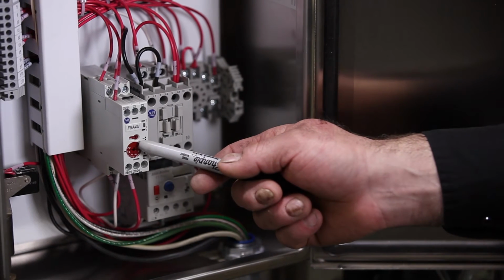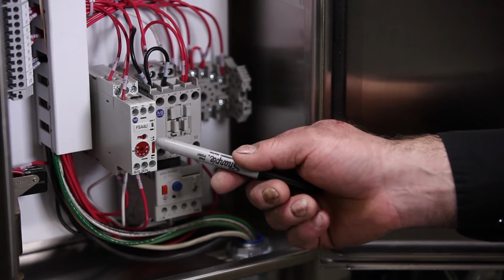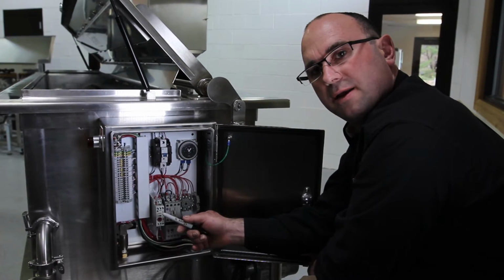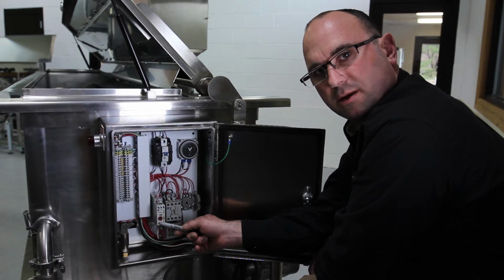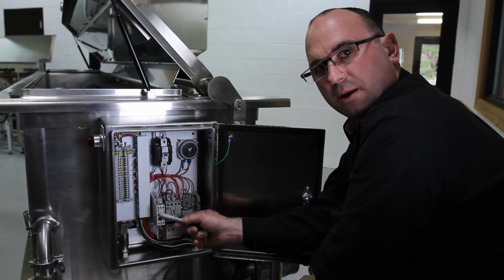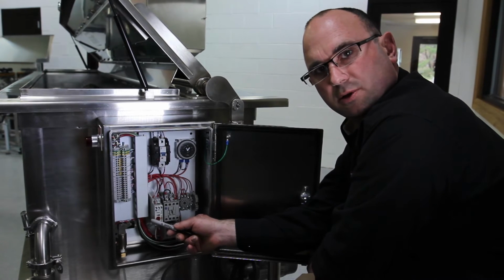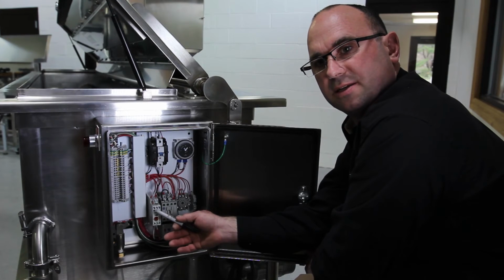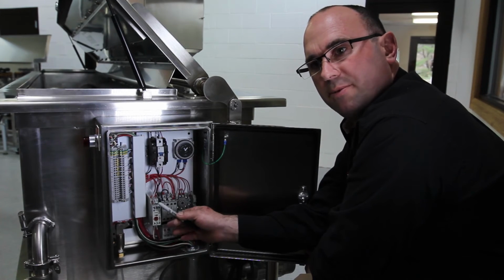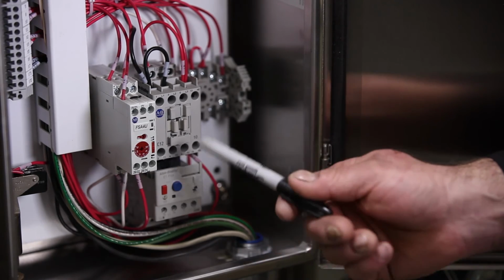This is the startup timer. No matter what happens when the tank is turned on, whether there's water in it or not, this is the timer that determines how long the tank runs with something wrong with it, let's say, okay? So this is adjustable. However, we adjust them so they run about 20 seconds no matter what happens. So that's the startup timer, I'll call it.